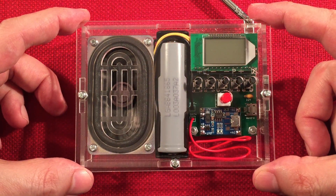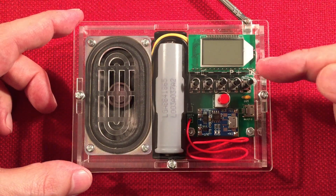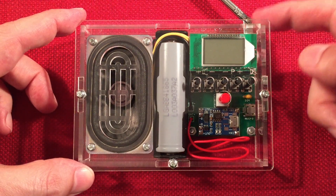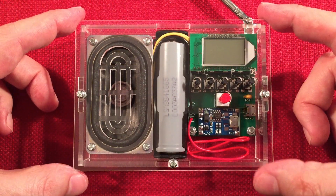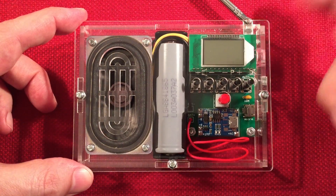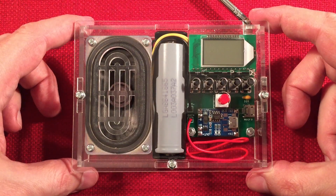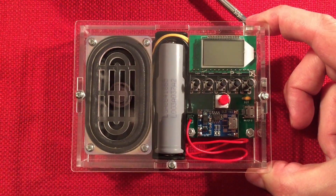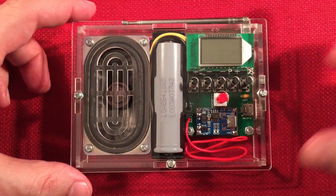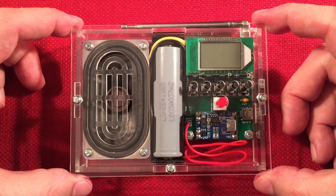The IC Stations GY18971 definitely gets a recommended buy, as long as you have the patience to put it together. It's not that hard, except watch that pin header — make sure it's 15 pins; if not, if it's 16, you cut pin 1; if it's 15, do not cut pin 1. And the FM antenna — check the fit, and if it doesn't fit, you may have to get hardware from a hardware store. I don't recommend drilling the PCB, but it worked for me. Everything's great — I love it. It's a fantastic kit, very portable. I can take it outside and walk around with it. That's the beauty of it — 18650 powered, using my 35-cent battery. Just charge it up and go. Plus I can prop it up and show it off as something I built.